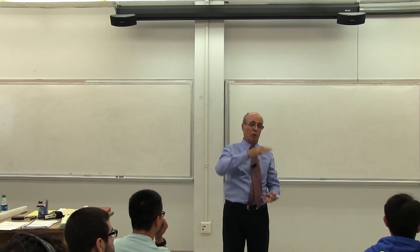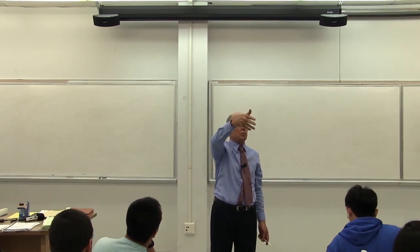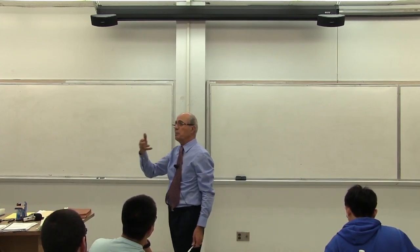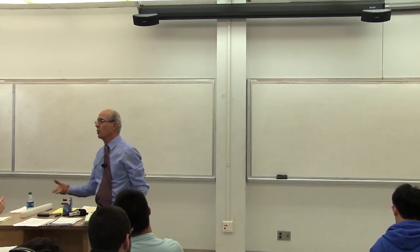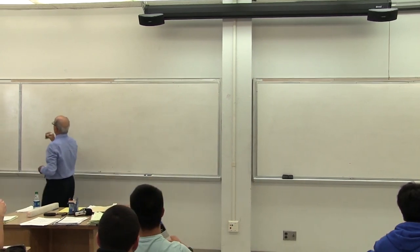So therefore, if the column becomes long, before you reach that, it's going to buckle, and because of the buckling, the P critical is much less than P of the crushing. Everybody, what was the formula I gave you? We derived that formula. P critical was? Pi squared E, yeah, that's right.